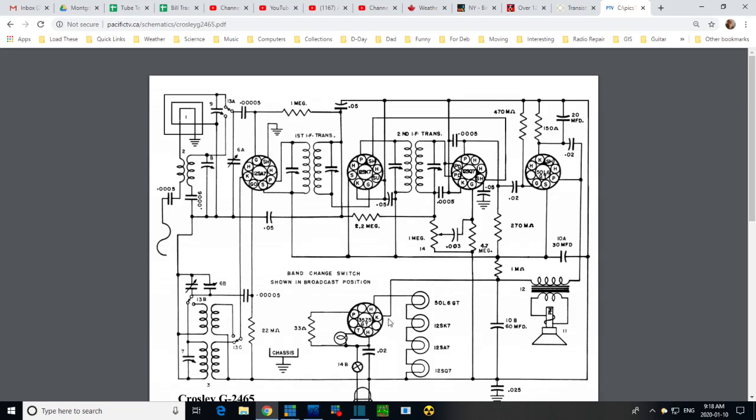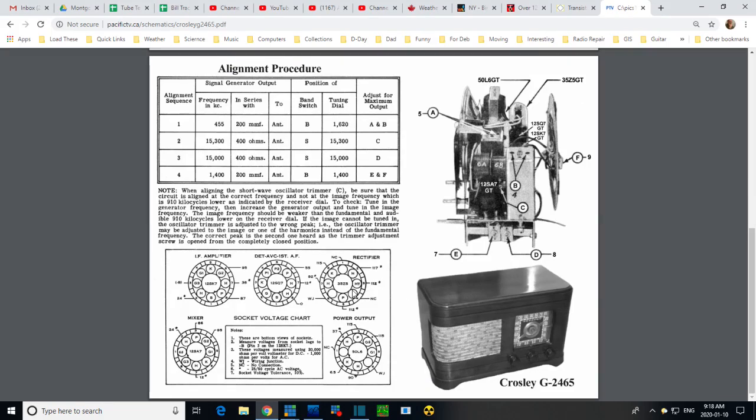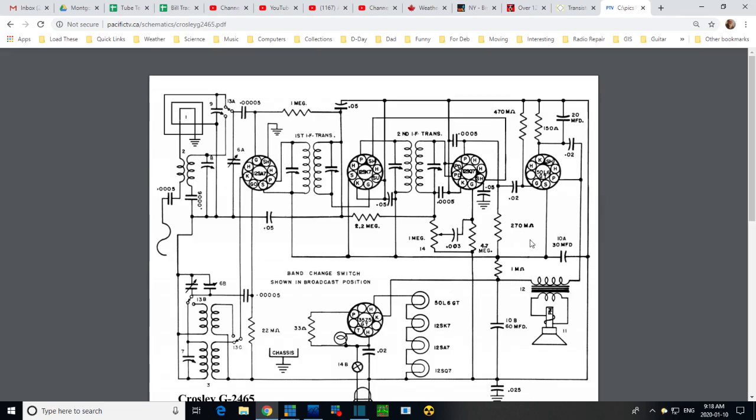It's connected over here. Now what capacitor is over here? Oh, look. Oh, okay. Did I make a mistake before? And I thought I replaced this one. So this capacitor's size, I'm looking at in the radio here, is 0.01, not 0.025. This capacitor's not in here. What the heck? Floored. So the 0.02, is there a 0.02 doing this from plate to cathode?